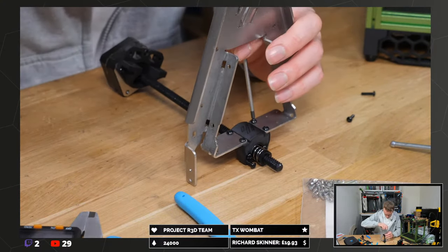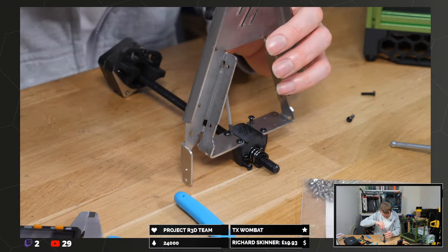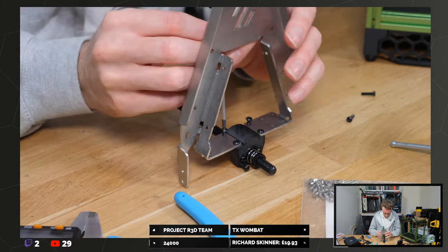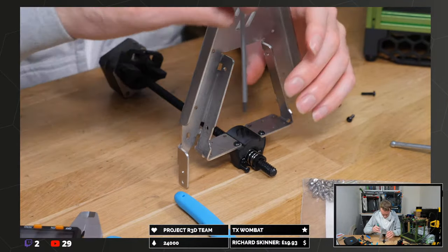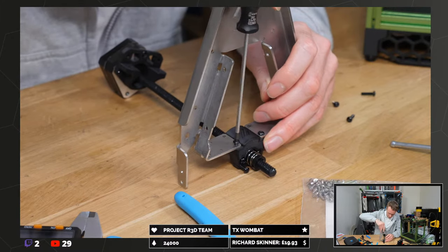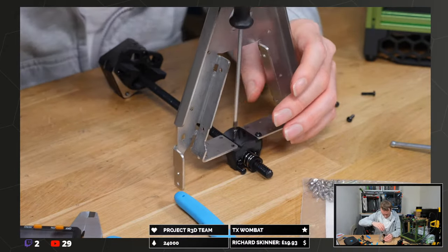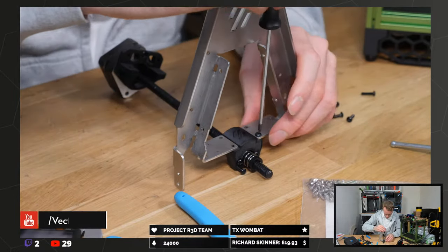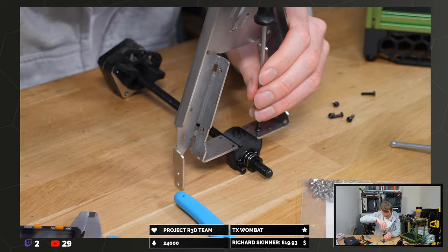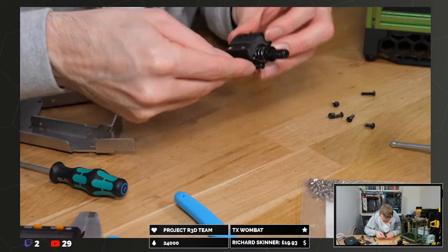Aluminium would be quite a good option, I think. Aluminium would probably be a bit easier to bend as well, not that it matters too much. But anodized black would look nice. They do have to be really well finished though, so it can be quite expensive. Anodizing is one of those finishes that really highlights any defects, so you need a really good finish before you anodize. Powder coat is generally a bit cheaper, but I think the tolerance on these holes is the most needed.